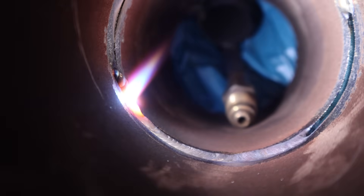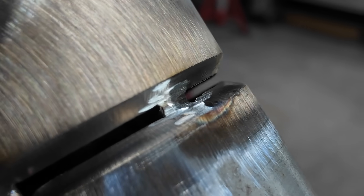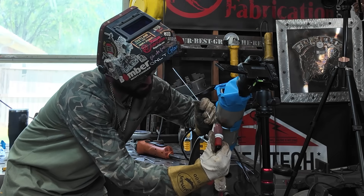This tack I'm not going to feather — we'll see if we can fuse it okay. This is why I always prefer to cut my tacks out with stainless. They can be a little more stubborn, especially if you don't feather them. I did feather that tie-in. I prefer to feather my tacks. The top tack is feathered paper thin. On the side, I've feathered it as well. I'm going to try to drop that heavy spot into my root and keep on going.